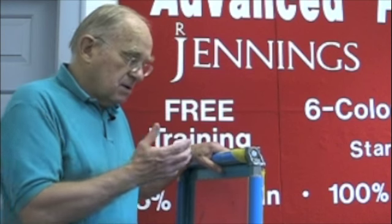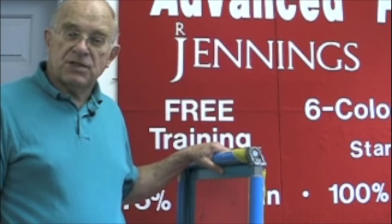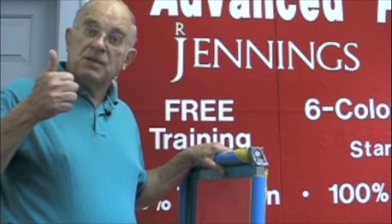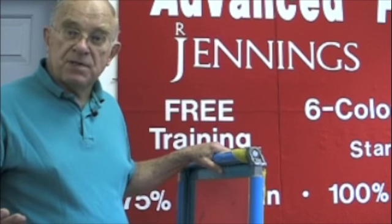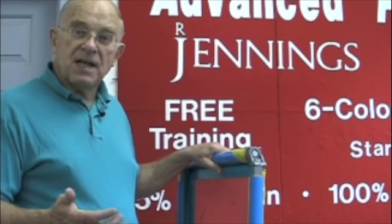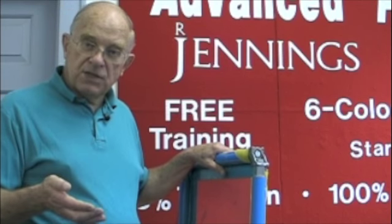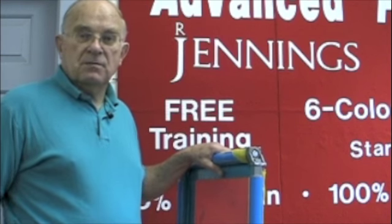Why? Because 2 hours after you've tensioned the mesh, you've lost 25% of the tension. So you retension, regain the lost tension, and raise the tension a little bit more. 4 hours later, another 15%. Do the same thing. Retension, raise the tension level. Next day, another 5%. So you've gone from 25 to 15 to 5%. You're losing less and less tension. And as a result, the mesh is becoming dimensionally more stable.